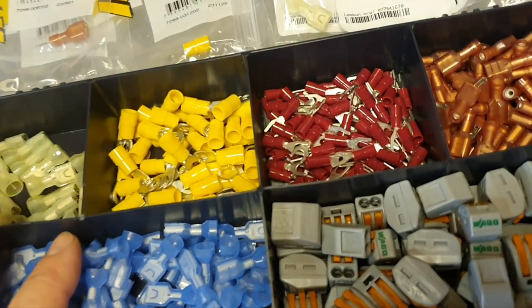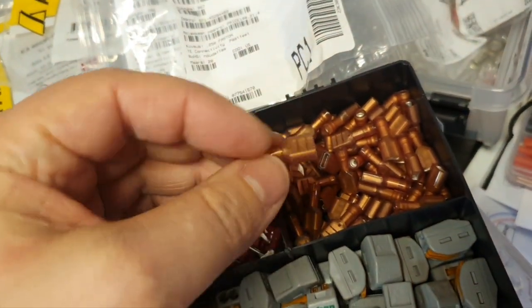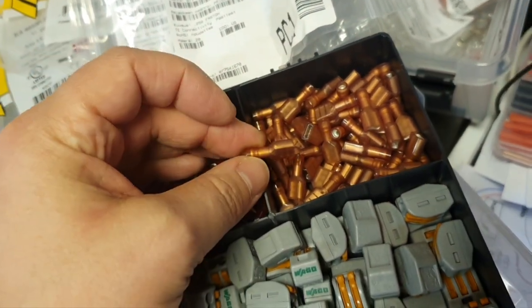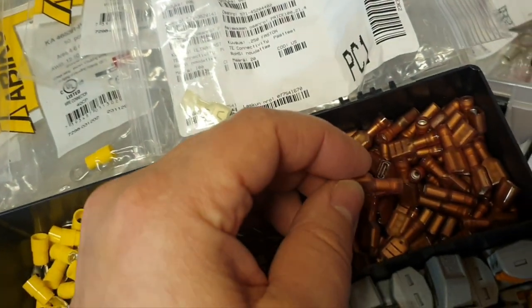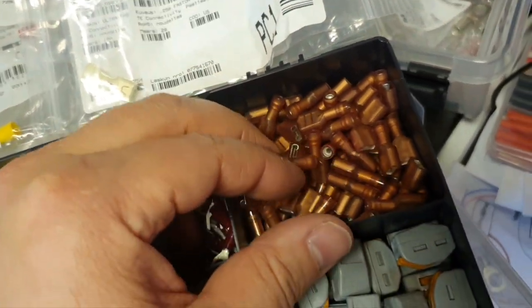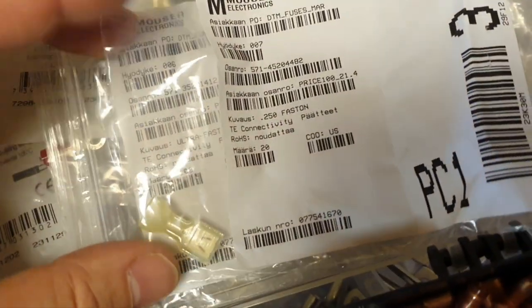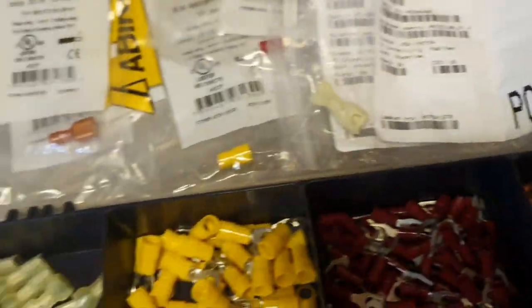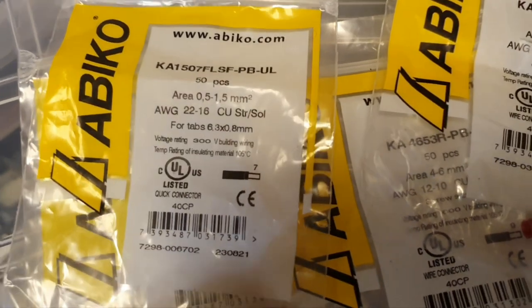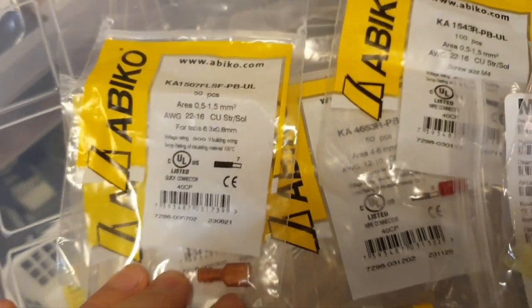Let's call them terminals. What is the right one? The right one is from a brand. So forget about Chinese options on eBay, Amazon, AliExpress. You will have a lot of problems. Just believe me, I crimp them a lot. It's total junk if it's not a brand. Brands from TE, from Molex, that you can easily buy from Mouser, they will be correct. You can find some in local shops, for example, like I found from this Swedish manufacturer here locally in Finland.